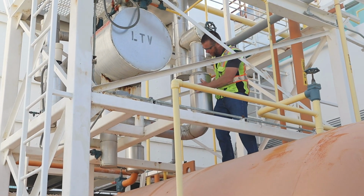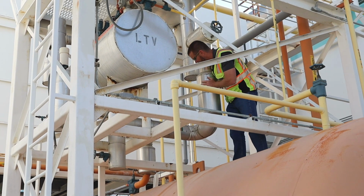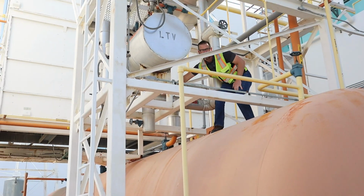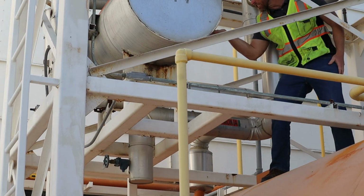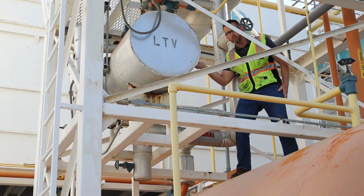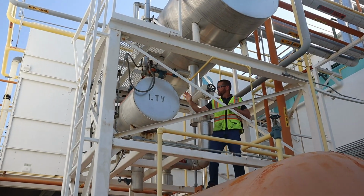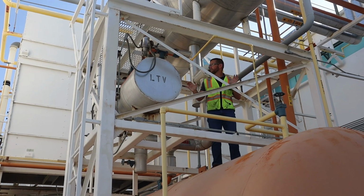And what you can't see right here would be a check valve, okay? And a check valve, and then into the bottom of that pipe here, which then surges into our transfer vessel. So the movement of liquid from the suction accumulator to the transfer vessel is simply by gravity.